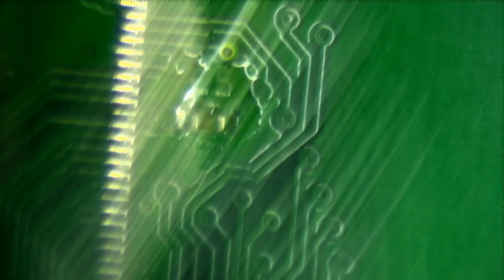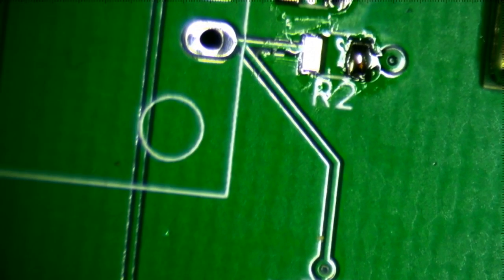All right, I think I got all the capacitors. Again, I'll solder their other sides later. So let me do these resistors now. These resistors are 4.7K. I need 4 of them. 1, 2, 3, 4. You can't ever really have too much flux. That's what they say.